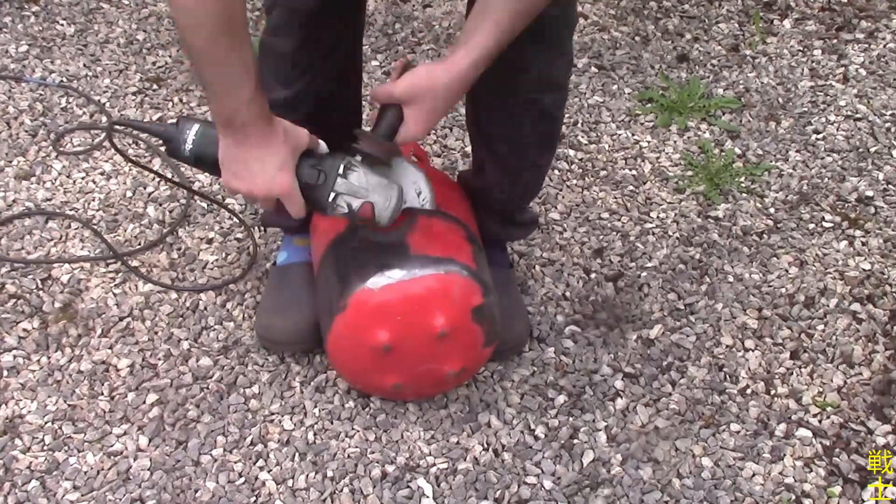With the walls fully intact, I don't need to fear the ceiling falling down on me when flipping it on its feet. With that, I can install the burner. I make sure to mount the burner flush with the insulation so it is protected a bit, as any exposed part would deteriorate a lot faster. In the meantime, I work on a door — the metal frame is from my old forge and made from some angle iron I welded to a hinge.